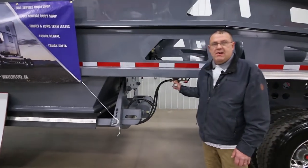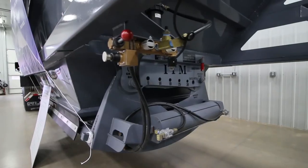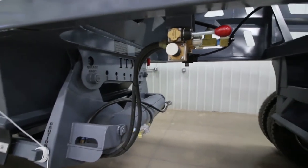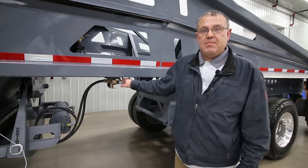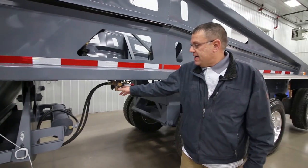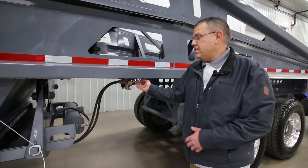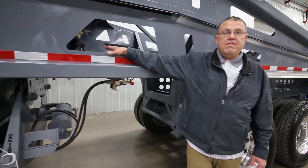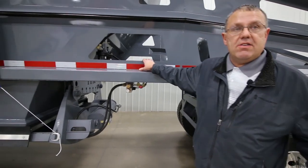Right here is your standard gate valve equipped on every ITM trailer. This one is your standard single solenoid setup — simple operation, just operated from one toggle switch up in the cab, open and close. This button allows a person walking beside it to feather it if you're doing asphalt or whatever you happen to be doing. These are lubricators and filters for the gate system to keep them lubricated and with dry air throughout.